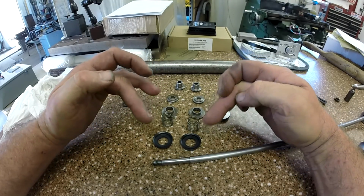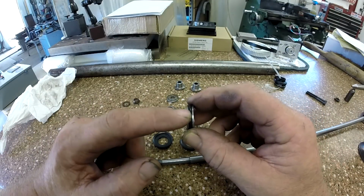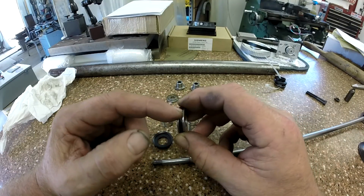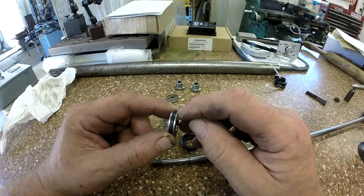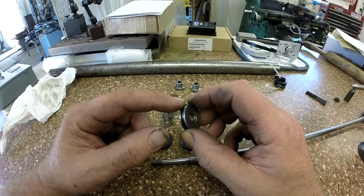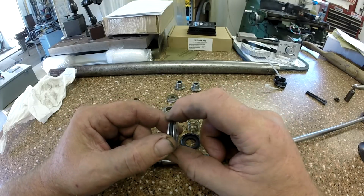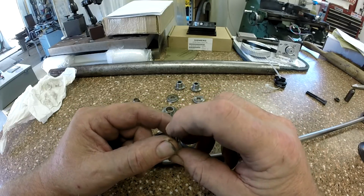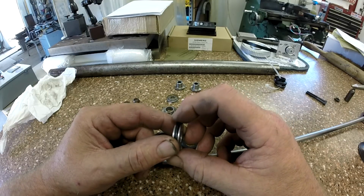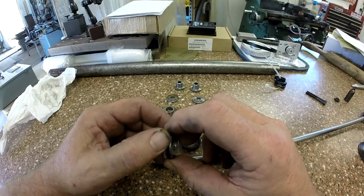You notice I've got two of everything all the way down, except the actual piston itself. Now, you're probably going to notice, hey, there wasn't an O-ring there before. I didn't like the drag marks I saw down the side, where I could see this was dragging on the cylinder a little bit. So I went ahead and cut a groove in it and popped an O-ring in there, a real tight groove. I don't want that O-ring rocking back and forth, so this groove is about 5/1000ths undersized from the O-ring, so it sits in there nice and tight. It's sitting about 5/1000ths proud. I cut the base of it, so I've got about a 5/1000ths crush on that thing.